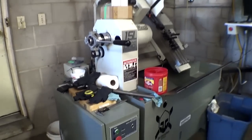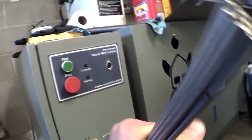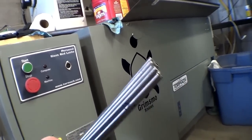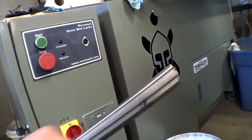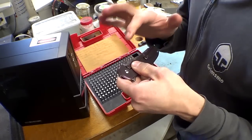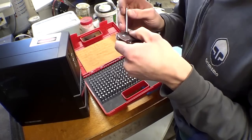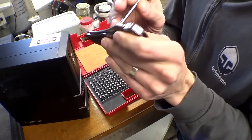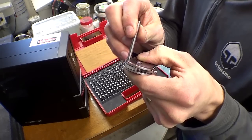The first step is to get rid of all the junk that's been piling up on the lathe because I haven't run it in a week or two. I bought some 3/16ths titanium rods, 6AL4V, so I have plenty. The final diameter needs to be 0.181 and this stock is 0.187, so I just need to kiss the outside diameter, drill a hole, and part it off — make it about 30 thousandths thick. Because this is a milled hole, I used my gauge pin set and it's going to be 0.183. 183 fits in there perfectly and it'll need a little shove to get all the way to the bottom. So if I make my spacer 0.183 diameter it should be perfect.